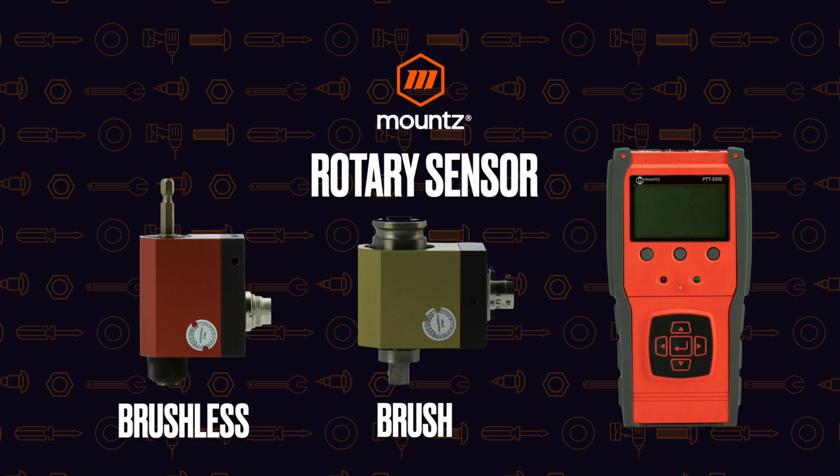We'd also recommend using a brushless sensor for the use of any type of pulse tool that is going to be used. This helps because of the way that the clutch mechanism works in a hydraulic pulse tool. You can get a scenario where you may see some brush bounce with a brush type of sensor. So using the brushless sensor helps to give you a better accuracy as far as the readings are concerned if you are using a pulse tool. Now, you would never ever want to use an impact tool with a brush or brushless rotary sensor, or any torque sensor for that matter, but that's something to keep in mind with the rotary sensors.